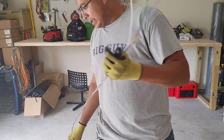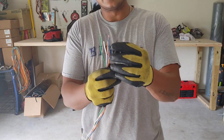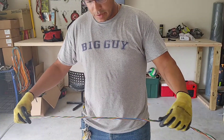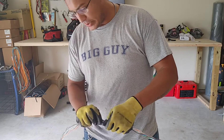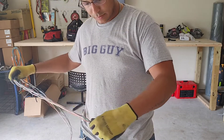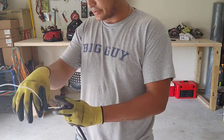Now we have our buffers exposed. It's a 48-count, so we're going to have blue, orange, green, brown — and you see this white here, this is actually a filler. If you're not sure if it's a filler or not, just come to the end and look. We have fiber sticking out of all of them, but if you look inside this white one you can't see the fiber, so you know it's safe to cut it out. When unraveling, you want to go to the straights and just untwist it and keep untwisting until it comes undone. Then go to your next straight and do the same thing. Get your filler and cut it out.